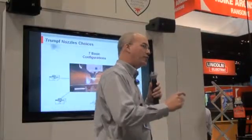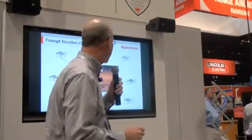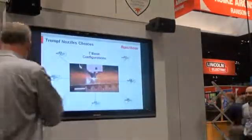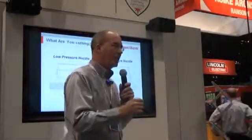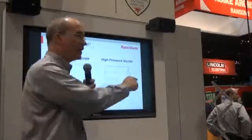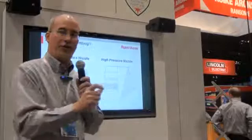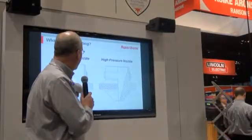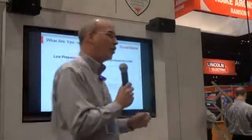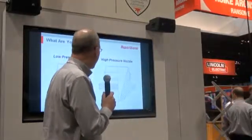It's not necessarily about the orifice size — it's also about the different configurations and geometry of these nozzles. Here we have two nozzles whose outside geometry is actually identical. If you were to see these from an external view, you'd think they were exactly the same, but internally they're quite different. The one on the left is considered a cylindrical nozzle — a low-pressure cutting application used for mild steel cutting with oxygen.